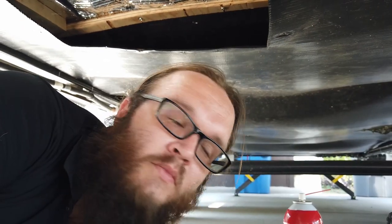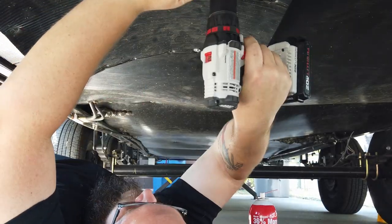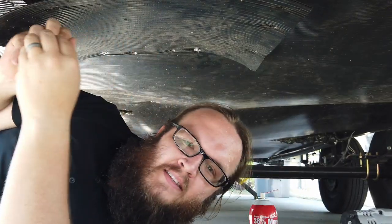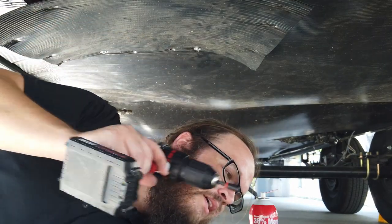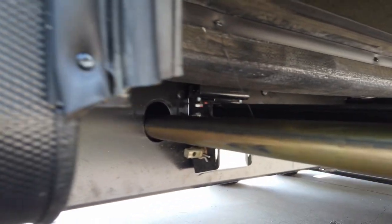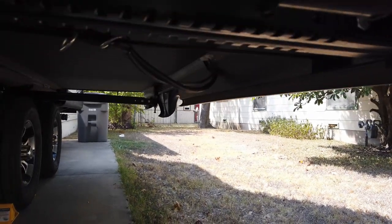Now to put the patch of the belly back in. After we get this up here, we're going to get under here and put a whole bunch of grease on our gearing and on that rack and pinion piece. We've got a gap here — it looks like we've successfully shoved this piece over. Now it's time to grease it up, grease up the tracks, clean up any debris, and test it out.